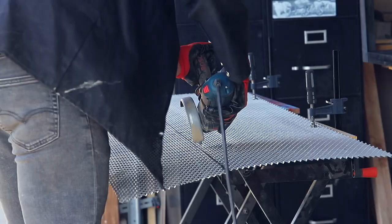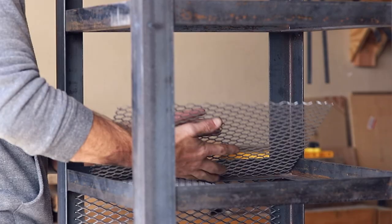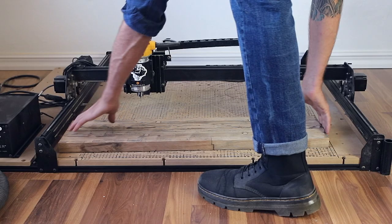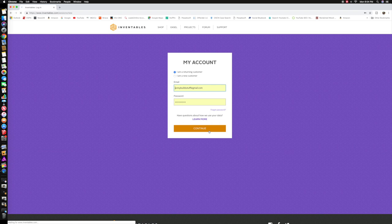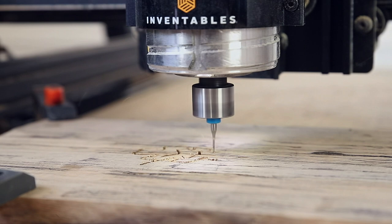With the center shelf in place, I could set aside the woodworking and trim out the console with the steel mesh. This expanded steel mesh cuts very easy with an angle grinder and a cutoff disc, so I cut the mesh to fit down into the sides and the back on each end, and then I tack welded all of these in place. I also added steel mesh to the front and back aprons on either end. For the wood inserts in the apron, I decided to add an oak leaf detail using my X-Carve from Inventables. I modeled the oak leaf pattern in Inventables' free software Easel. The software is very intuitive and easy to learn. I just did an image trace of an oak leaf drawing, and then arranged them in a pattern I thought would enhance the look of the console. For me, having a CNC isn't about doing completely digital fabrication projects. It's more about having another tool in my shop that aids in the overall design of a piece.